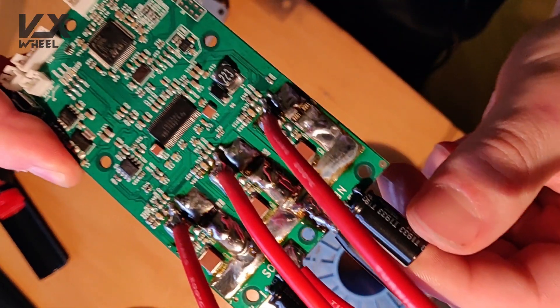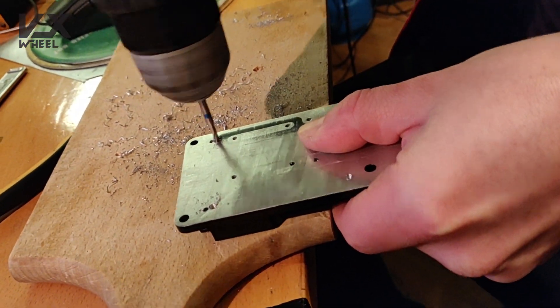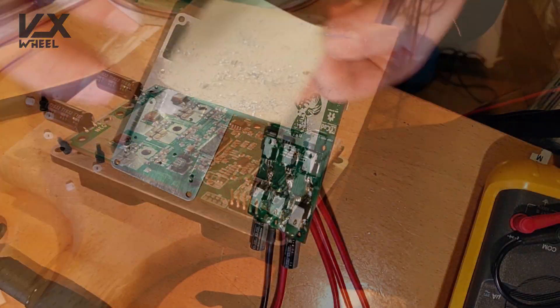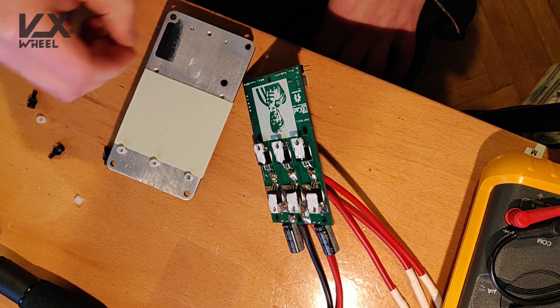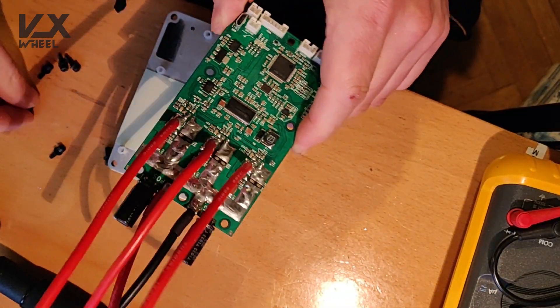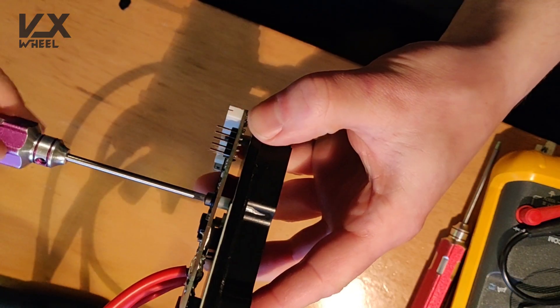This is how it should look, and don't forget the heat sink. The pads should not be connected to the heat sink, so make sure to isolate those from the heat sink. You can do that with a gap filler, but I suggest you also add a piece of Kapton tape in between them.